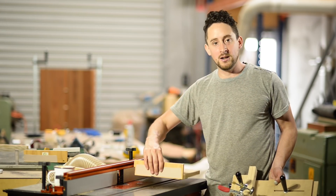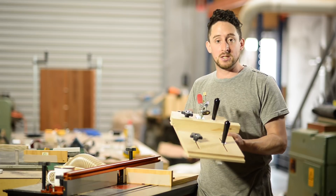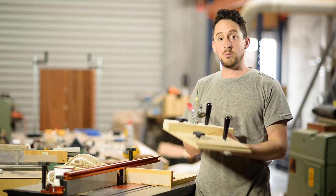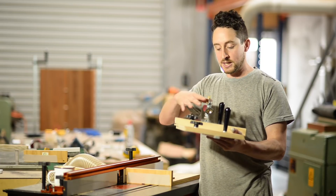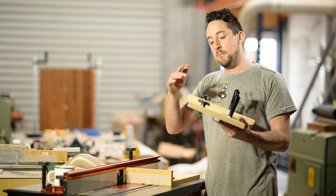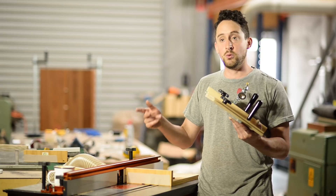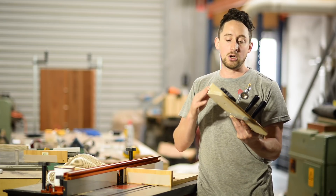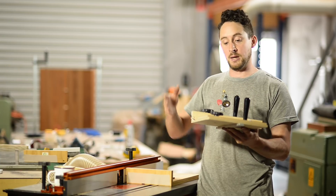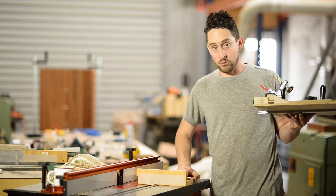You might see this little jig I've made and wonder why I'm not using the coping jig which I've specifically made for this kind of purpose — and you absolutely can. This is a little kit that we've put together; you can grab the components from Timbercon and make it to the specification that perfectly suits your job. If you were doing a whole bunch of box making you could make a fantastic solid little box-making jig that holds everything in place perfectly. My one was designed for use with a coping bit, which is a slightly smaller diameter than this box cutting bit — meaning I'd be damaging the face of my coping jig. So I want to preserve it for coping jobs, but if I was doing lots of box making I'd make a dedicated one the right diameter for this bit.